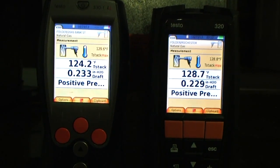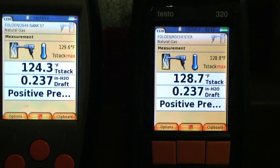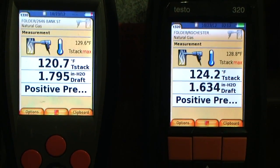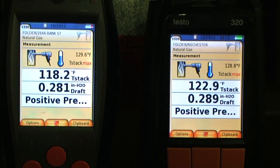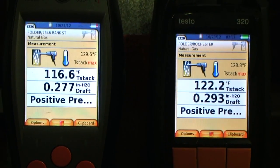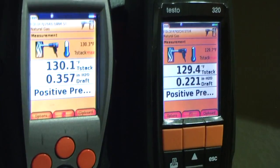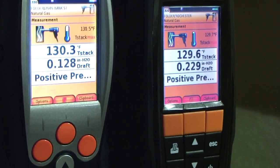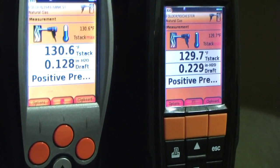So we're waiting for it... he blocked off too much — it just killed my burners. But you'll see how high it jumps up. He's taking his hand off and putting his hand on. If that number is real high, it tells you that you've got a blockage somewhere. When you're measuring draft on a 90% efficient furnace, this should be reading 0.02 to 0.08. His is reading 0.2, which is too high. We'll let Fritz explain what the problem is.